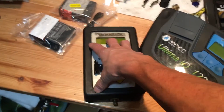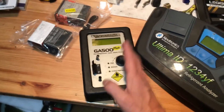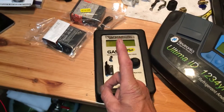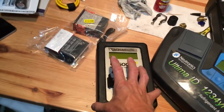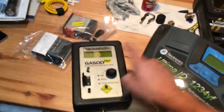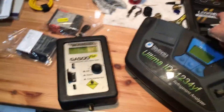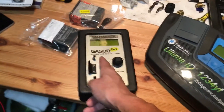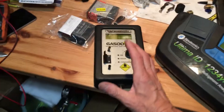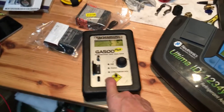This one is now dying intermittently. I can only use it one or two times in a row, then it stops working. If I let it sit for several hours or overnight it'll work one or two times again. Its accuracy is still good — it matches the other units on the same tank of gas or the same car — but I think a capacitor is going out on the circuit board. I hope that's all it is because then I can repair it.